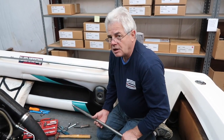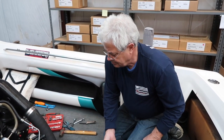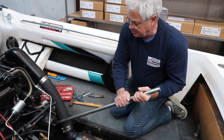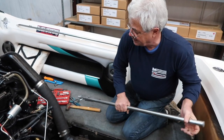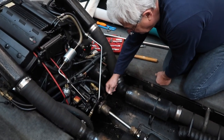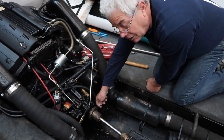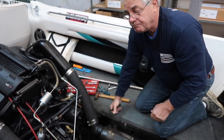We moved it a little bit — we're only talking about maybe three to four thousandths of an inch — so it doesn't take very much to get the engine alignment dialed in. We just pry a little bit more on that mount. You can hear the engine moved on that one; there's a little sound that tells me it moved. Check your distance and we're good all the way around. We can tighten her back up, and that's how you do an engine alignment.